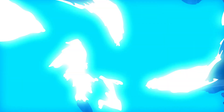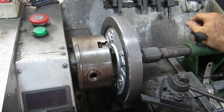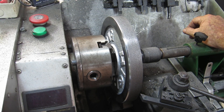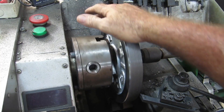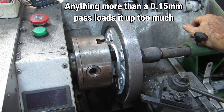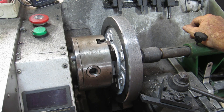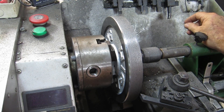Well viewers, the doubts I had about whether this thing was cast iron are well and truly past — it's definitely cast iron. I'm having a hell of a time turning this. I've spent over four hours today just getting it down to that and I still have around 10 millimeters to go on the diameter. It's going to take me a couple of days because I can't get more than a couple of passes before the motor overheats. I've had to pull the cover off the end to let some air in, then spin it and run a fan to cool it down. Oh Jesus, I think this is going to be a long series.